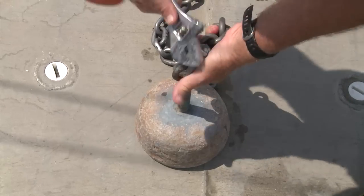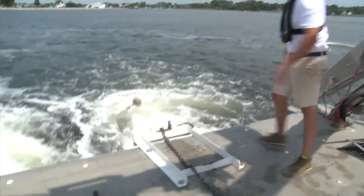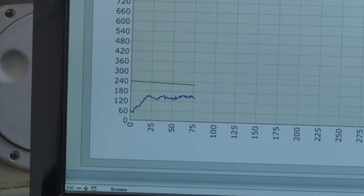This is interesting because it demonstrates that if an anchor doesn't pull more than that, the difference between 55 pounds and whatever the anchor is doing is just due to the anchor itself. We also found an approximately 45-pound piece of lead used to hold down scientific instrumentation — not a great anchor shape, kind of like a mushroom. We threw that out on the end of the rode, and at five minutes we got a tension of about 136 pounds. So you can infer that if an anchor doesn't show more than about 135 pounds, the shape of the anchor is not engaging the bottom at all — it's just the weight dragging.